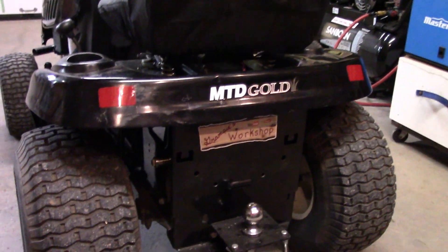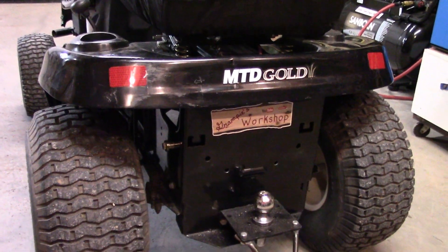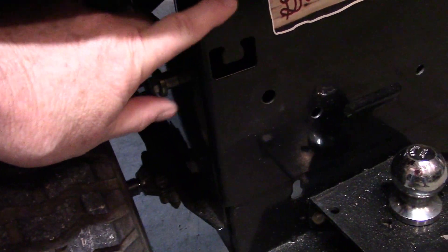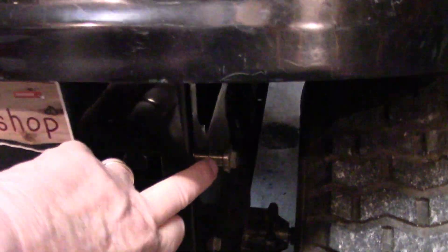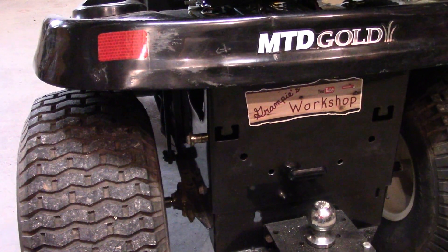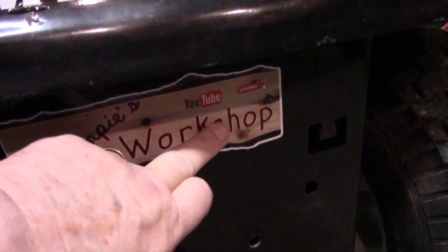Because I have no idea what I'm going to end up with here. But I've been looking at the tractor for a while and I've got kind of an idea how I might be able to connect this. If you look in here — and I know the lighting is not great — but right here there's a pin. What that is is a bolt with a shoulder on it, and it goes through this part of the body, and that part is pretty hefty, strong steel. There's another one on this side at the same height, same relationship to the axle. I'm thinking they must have been put there by the manufacturer to hold something. So I'm going to try to incorporate that into a mounting bracket of sorts onto the tractor.